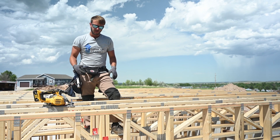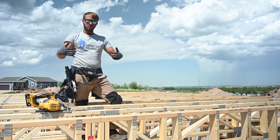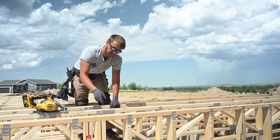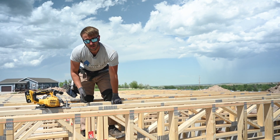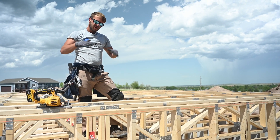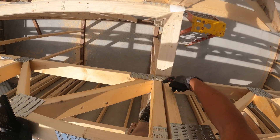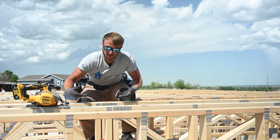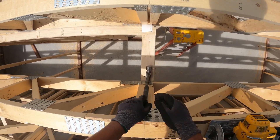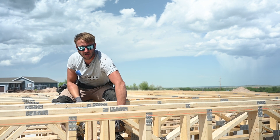The last thing we need to do is make what we call relief cuts. They build two trusses in one, and then we just cut it right here and it drops down the crown and sits on the wall. After we make all these cuts, we're going to come back and put shims in to level it out perfectly, because we build our walls about a quarter inch short and that gives us room to adjust our shims. The important part is cutting right through this gap between the plates. You can see there's an end board on each of these trusses — we have to cut through this board. I like to put my hammer under here since we're floating and spin it down. That supports the truss so that it doesn't bind your saw.